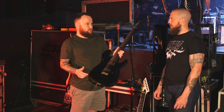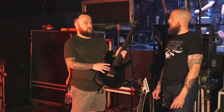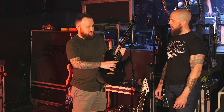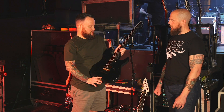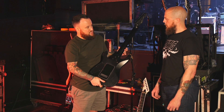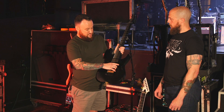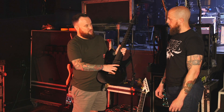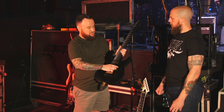Both of those were neck-through with a pickguard, so the neck ran through the middle of the wood and the pickups were attached to the pickguard rather than mounted into the body. For this version I wanted to make changes to improve the tonal benefits, so I ended up making it bolt-on instead of neck-through, and also direct-mount pickups instead of a pickguard. The pickups are sitting in the wood — one solid massive piece of wood — versus having wings with pickups suspended in a guard. I definitely feel it's helped with the resonance and tonality of the overall guitar.